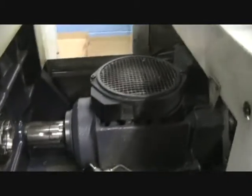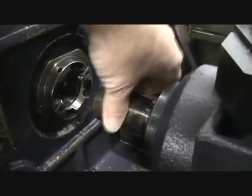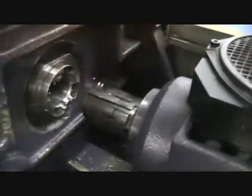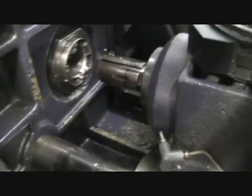Inside of the machine you can see the headstock. This does have the interfacing of the main spindle and the rotating guide bushing. How this machine works is that you have the engaging of the splines on the main spindle to the splines on the back of the guide bushing for a synchronous rotary guide bushing.